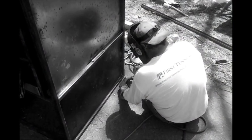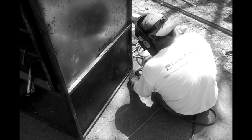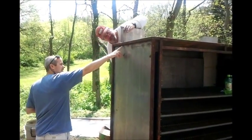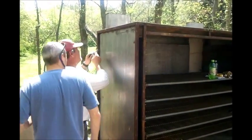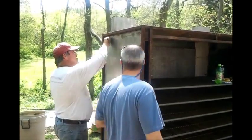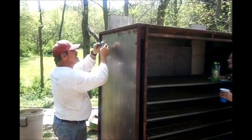What Dresch is doing right now is putting in the sides down in the bottom — the inner side. We'll have an inch there for insulation, then put our outer walls and put our shell around the whole thing. We're checking the seams, and any place we've got gaps, we're filling with high-temperature caulk to make sure we fill in any seams and don't have any air gaps before we put in the insulation and then the outer walls.